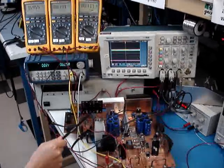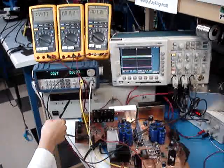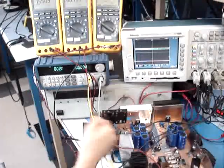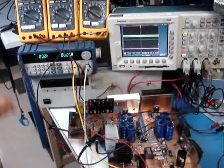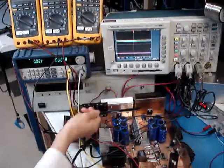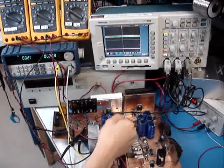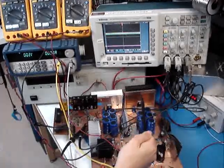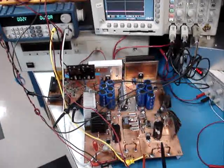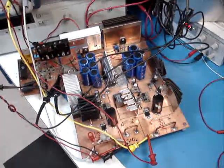This is the testing setup for the low-level charge and storage system of RPS. I will use this voltage supply as an alternator, which can supply 12V to the capacitor. The voltage from this power supply will charge into these parallel branches of the capacitor. When the capacitor is full, they will stack together to put the two branches in series to double the voltage. The voltage of the whole capacitor system will boost to either 48V to accelerate the vehicle, or 50V to charge into the battery.